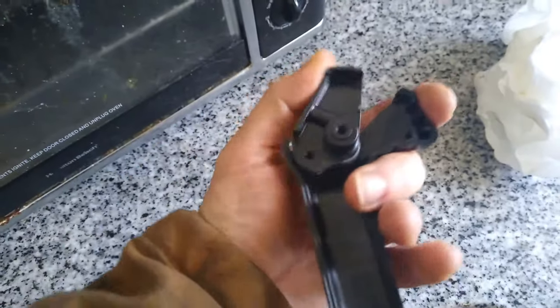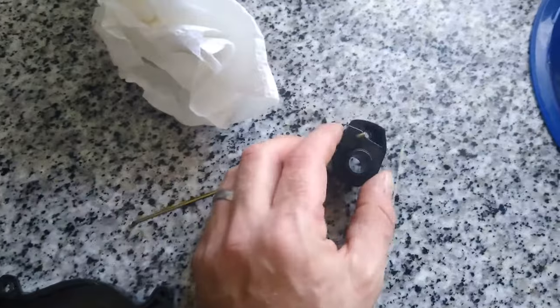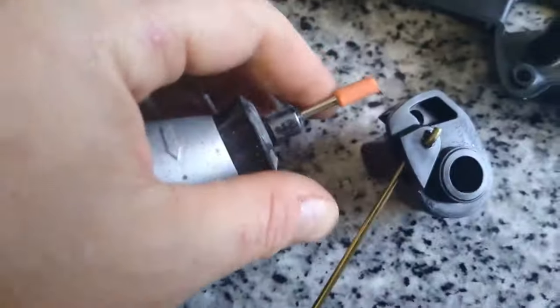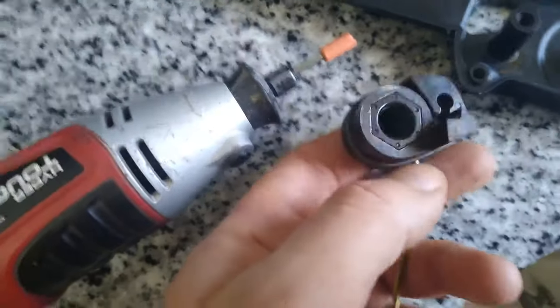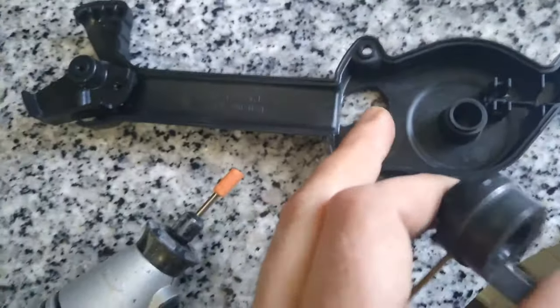This part here is not causing an issue, but this one here is. I'm going to take a Dremel and file just a little tiny bit inside here to make this a little loose-fitting, because even right now I can't pull it back off — it's really tight. I'm going to use a cheap Dremel with a grinding bit, stick it down inside, and go around in a circle on each side. You don't want to take a lot — just enough to get the friction off so you can put a dab of oil in and have it move nice and free.